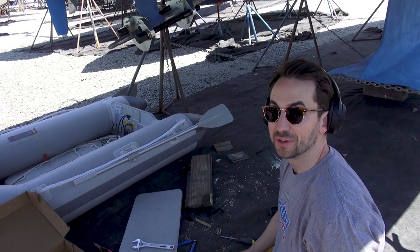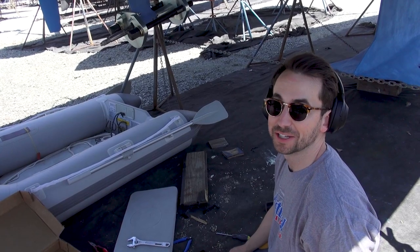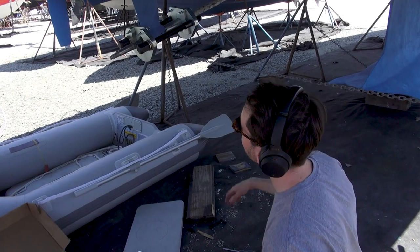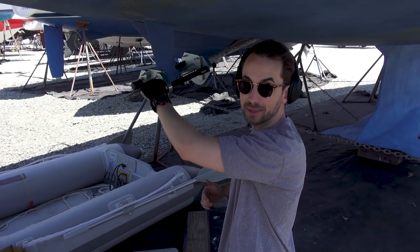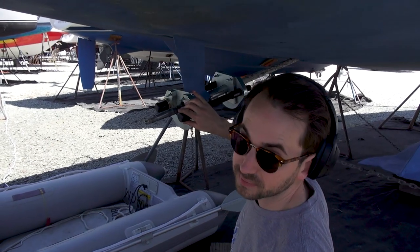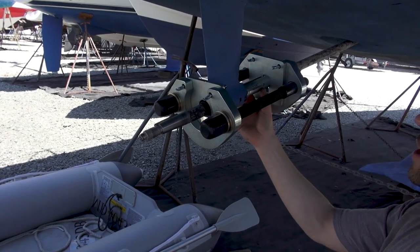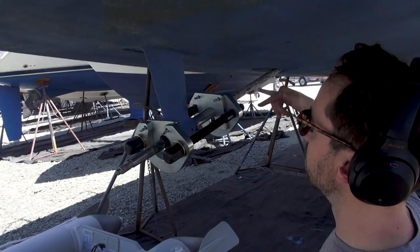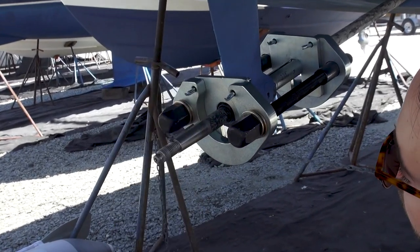The reason I'm wearing headphones is because the cutlass bearing — they said it pops in the instruction manual — and it sounds more like a gunshot going off right next to your head. It's popped about three times now, so I figured I'd put my headphones on to protect my ears. If you bring the camera in a little here, you can see that the cutlass bearing is coming out. These pieces here — they're called collets — are going through the cutlass and essentially pushing out that cutlass bearing.